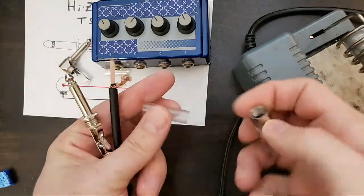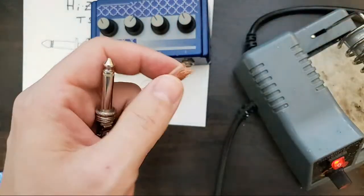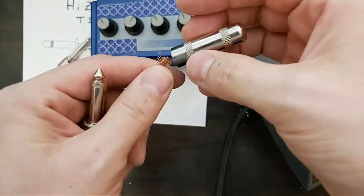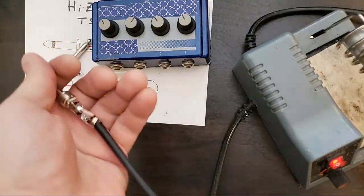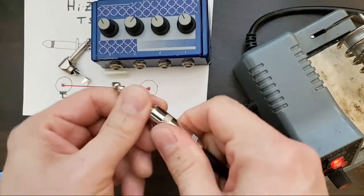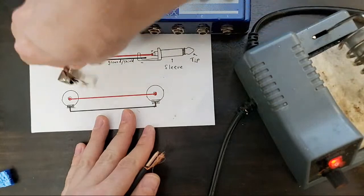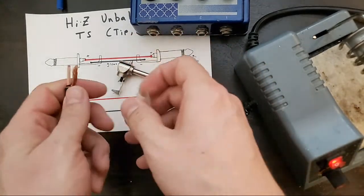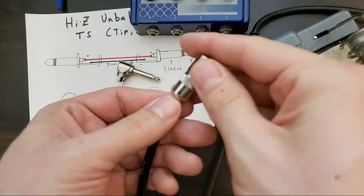Inside each casing is a little insulated piece that's going to go on first, and then the case. So that goes up, this tightens up, and that's side A. Side B. So we did the tip, we did the sleeve, there's the strain relief. Here's side B. Most important part about side B, put this stuff on first. Otherwise you'll be unsoldering your cable and putting it back on.